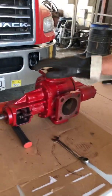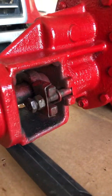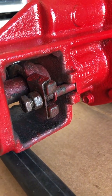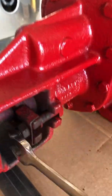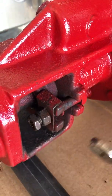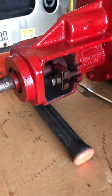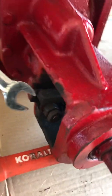When you look at the Roper pump as a whole, the first thing that you notice is right off the main shaft here there are these lock nuts and the adjustment nut. What this does is it tightens the packing so that you can adjust the packing on the road. All you have to do is loosen up this nut here and tighten this nut up here. When you're on the road, if you have product leaking out of this point right here on the front, it's the packing, and you can tighten that on the road. With the pump shut off, equally tighten both sides — this side and on the back side, which is right here in the same location.